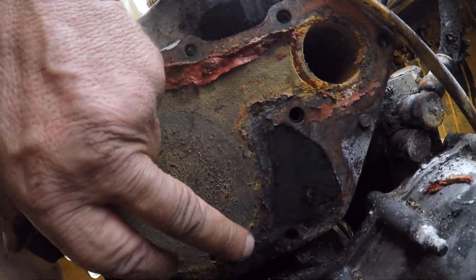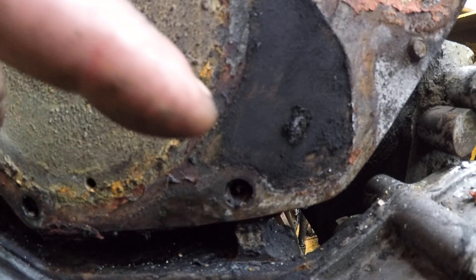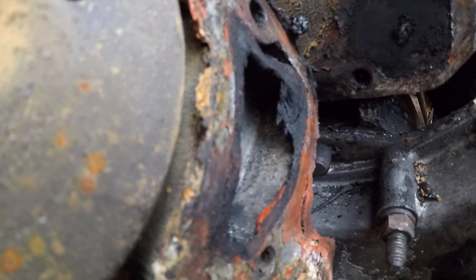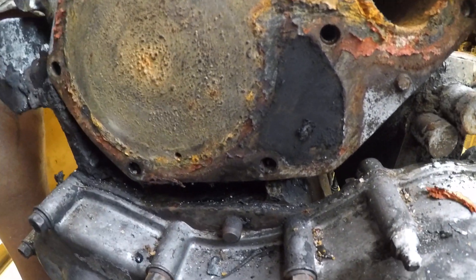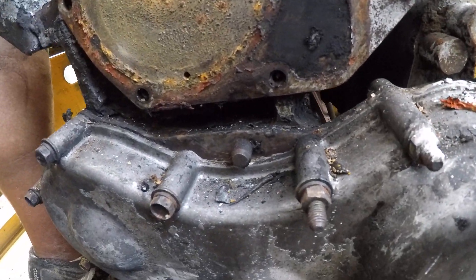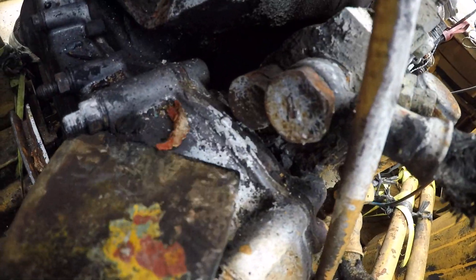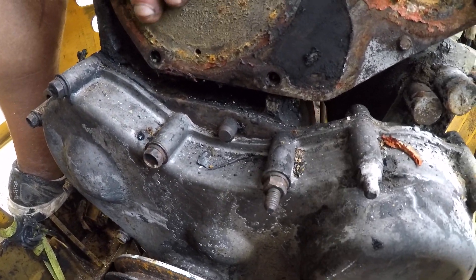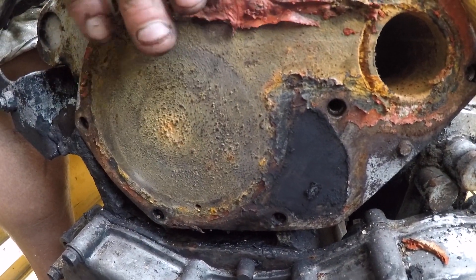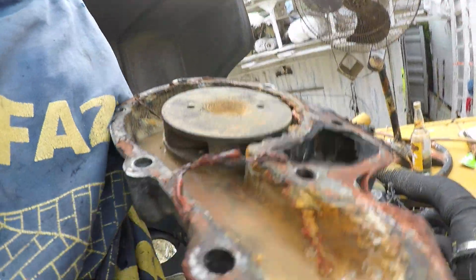This area here is where the oil was leaking out — you can see it's wet with oil. The water was leaking out of these two bolts; you can see the former gasket is black. This has been getting oil on it for years and years — I power washed it but it's still got an eighth of an inch of grease where the power washer couldn't reach. Now I'm going to scrape, sand, and polish this plate to get a good surface for the back of the water pump housing, which is starting to corrode.